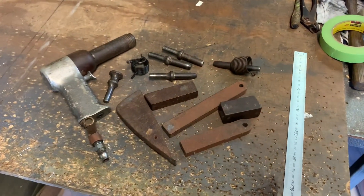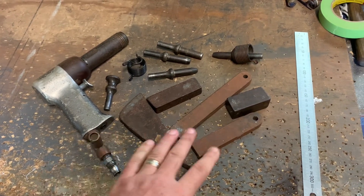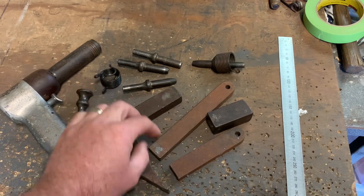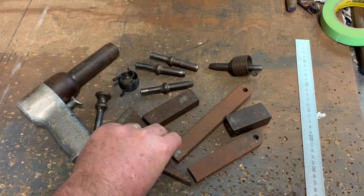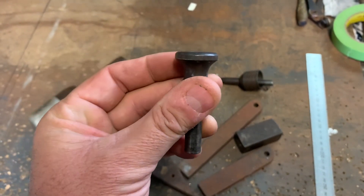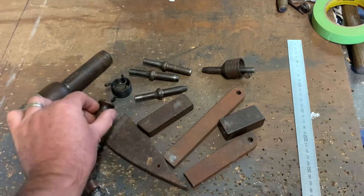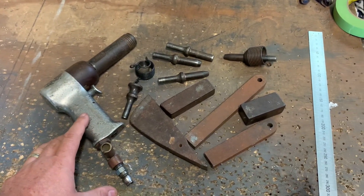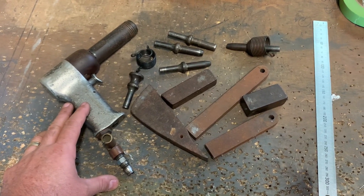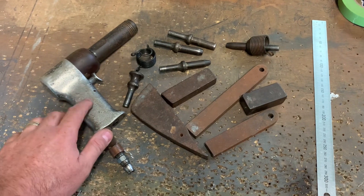This is what I've used to build Frankenstein - my 4x rivet gun that I've had for about 22 years, and my collection of dollies. This is my favourite, and then there's these little ones in different shapes to get into all the weird nooks and crannies. This is the flat snap I use - I prefer this one. See how it's got a little bit of a curve to it instead of being completely flat? That way it doesn't mark the skin if you're not quite square. I prefer the 4x. They come in a range from 1x right through to a 10x - we had one of those at work once and you could hear that thing going off even across the tarmac.